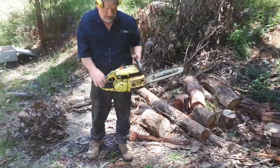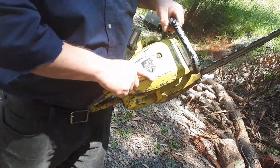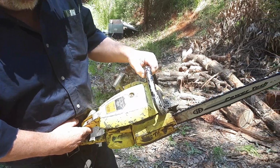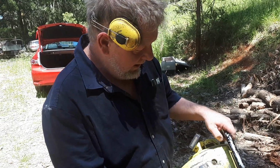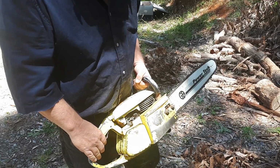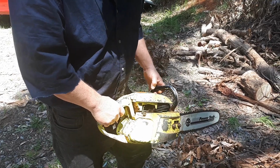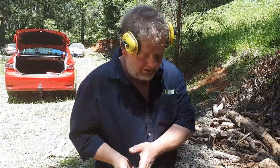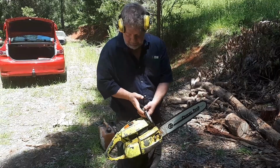Okay, friends, today what we've got is the old Skil 1629 Type 3, made in Chicago. For those that know saws, this is a sort of second generation Canadian PM, Power Machinery kind of thing. 68cc, 3/8 chain. I'm guessing about a 16-inch bar.